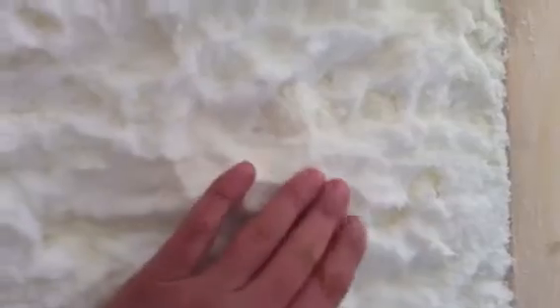It doesn't smell too bad, this particular foam — though I wasn't here when it was sprayed. As I said, it's sprayed with a water mist which then reacts out with the PU foam and dries very quickly. It certainly feels completely dry; I understand it's about an hour for the water to react out.